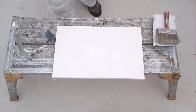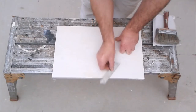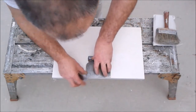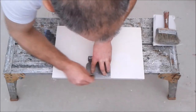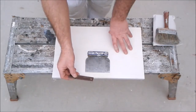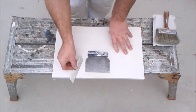Okay, so this will be now dry enough to carve. Not too much coming off this time, it'll be in the second fill. Okay, you don't want to leave too much excess, anything sticking over the edge. Great big build up of filler, because it's always a lot harder to sand out. By using a blade or even a small hacksaw blade, you're able to just carve this.